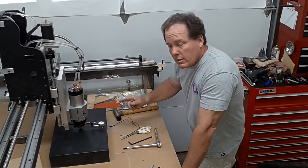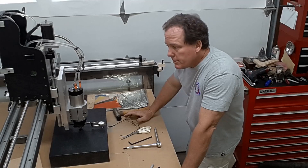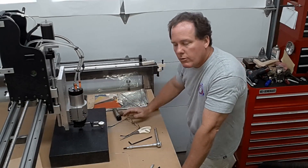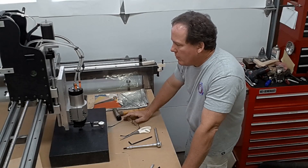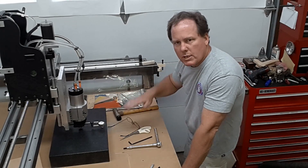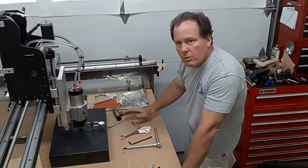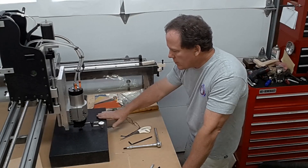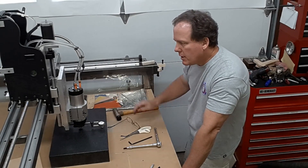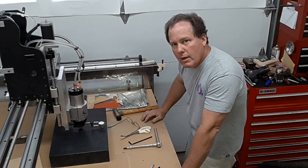I am super pleased with how this has turned out. It's trammed in better than I had expected it to, and between that and the extra bracing we put up in the gantry, I think those are going to be a lot of improvement for this machine — especially when cutting bottoms, I won't get that stair step nearly as bad. I'm going to clean up everything here, put the surface plate and indicator away, then break out a piece of Corian and make some test cuts. Thanks for joining me in the shop today, and we'll see you next time.